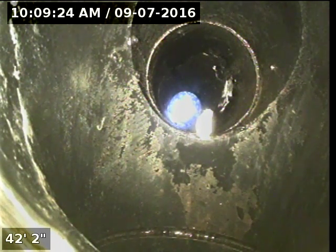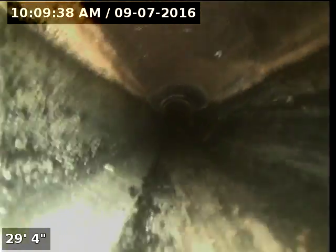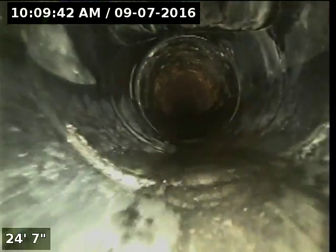So we're at the end of the line. The ABS going in toward the house is in good condition — no major problems, no standing water. We went ahead and flushed one of the toilets and everything looks good going in. We're going to pull back and go back down into the main line heading downstream, entering the other cleanout on the top end of the driveway.